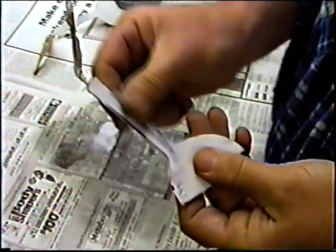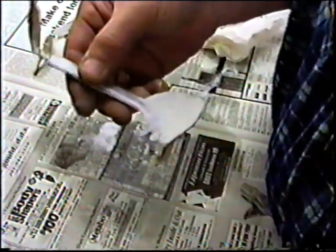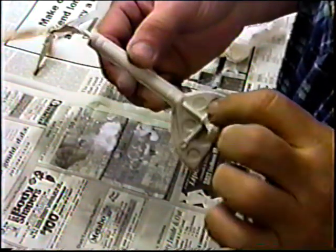Finish when it's sanded with 1200. Boy, it's just perfect. Really nice. You can see it fills in all the little imperfections and scratches. And of course, if there's a spot like here that needs it, I can just sand this down and put another coat of primer on it. It won't matter at all.